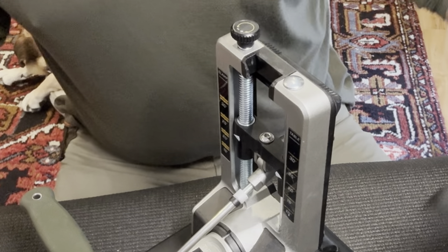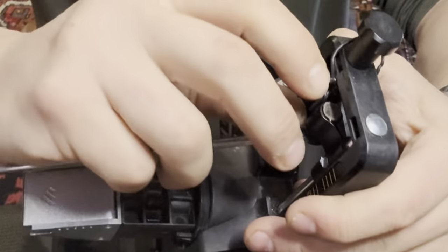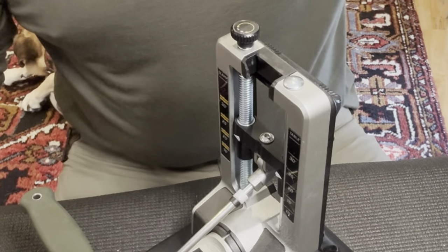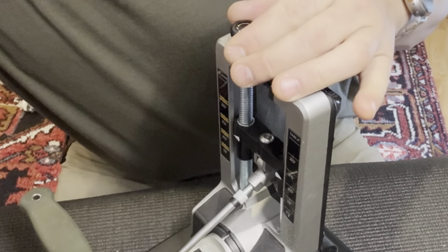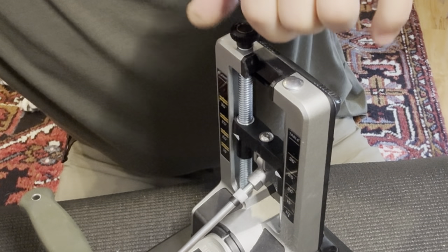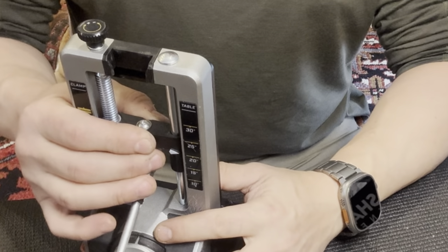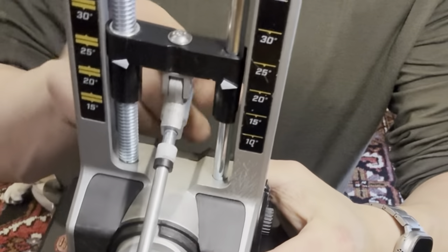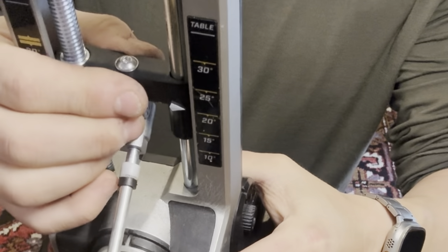What they fixed compared to the old one: the old one had an immense rocking in the entire assembly. The threads were pretty loose and the entire thing was flexing and rocking. That's why they made this frame out of aluminum, and they fixed one major issue — the play in the adjustment screw versus the bushing that runs on the screw. But unfortunately they left this opposite side pretty primitive. It's an open sleeve design with a little bit of a leaf spring molded into plastic, but this leaf spring doesn't leave enough tension to prevent this rocking.